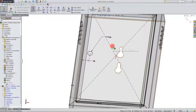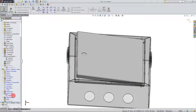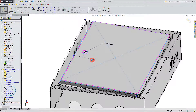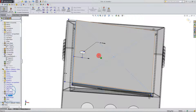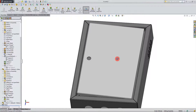We can just exit. Just like we did with the other part, because we were editing the base flange and creating a closed profile inside the base flange, the feature updated immediately because there were no problems. SolidWorks understood that there was a closed profile with another closed profile inside of it and that it would update accordingly. I'm going to exit out of here and you're going to see that our hole is propagated on our part.